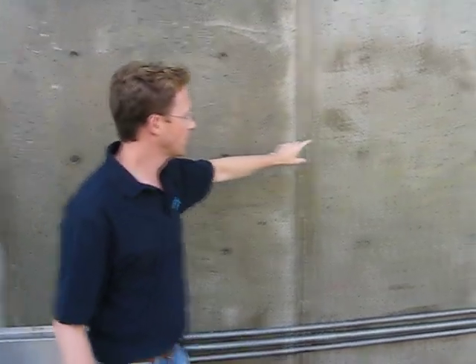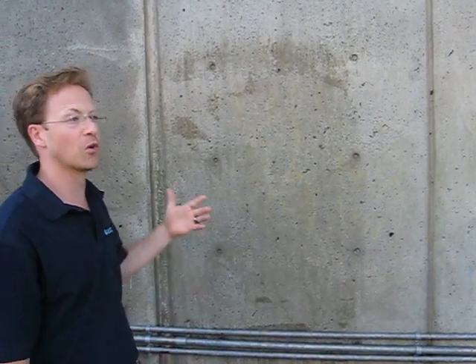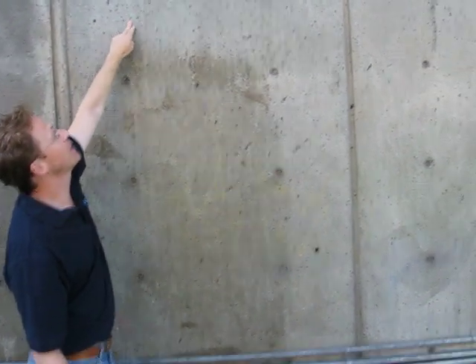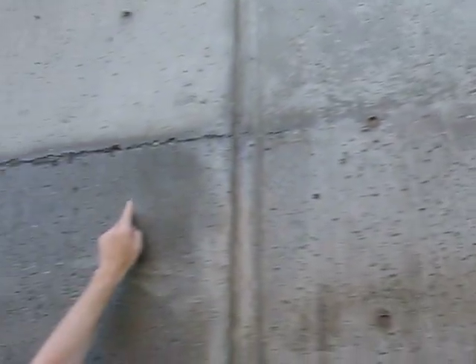Moving to panel two, we put one coat of our sealer down — a very light coat of the sealer, SCS002SP — which is a bonding agent for the proofer, but also maintains the color integrity of the substrate. If you go to this line up here, you can see that the color differentiation from here to here is much less than from here to here.